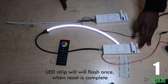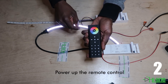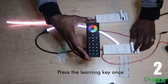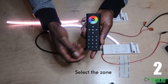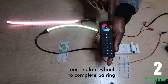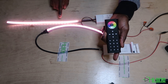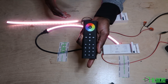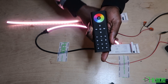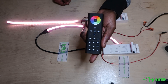It will flash. Pick up your remote control, press the power button once, press the learning key once, press the zone — for example, zone six — then touch the color wheel and it's now paired. This light came on but that's just because I had powered it off before; this shouldn't compromise your ability to pair your remote control to another LED controller.